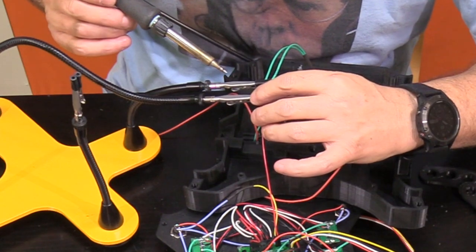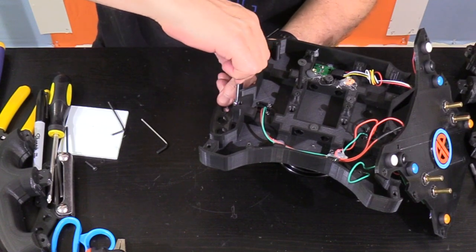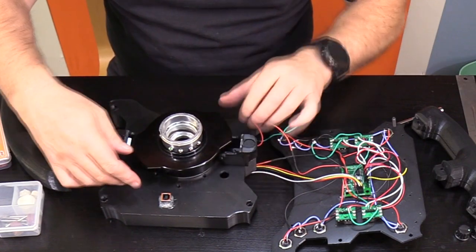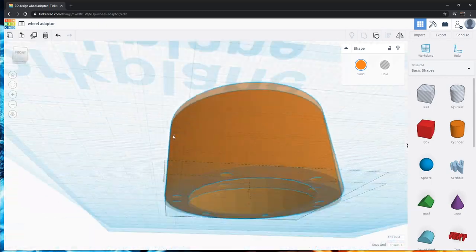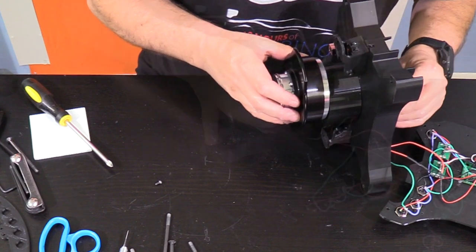At the end of the paddle levers are two holes where we can bolt on our paddle ends. Before we close the wheel rim up we still need to mount our quick release, as the mounting holes are actually inside of the case. My quick release is rather large and when I went to mount it this presented our next problem requiring a solution - I needed a spacer. It was back to TinkerCAD for a quick design, eight hours of printing later we had a spacer, and we could actually mount our wheel to the quick release and then close up the wheel.